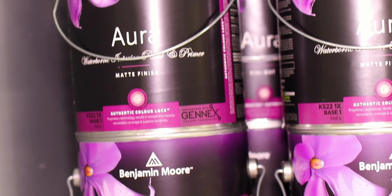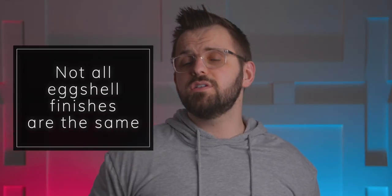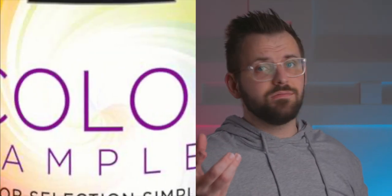If you want to know more detail about finishes, I'll link our finishes video down below. If you are really set on something like a matte finish, just know that the tester pot you'll get will have paint that'll appear a bit shinier than what you'll end up getting. Speaking of that eggshell finish, here's another quick pro tip: not all eggshell finishes are created equal. The actual sheen level can differ slightly between the same finish in different products, and this can be very problematic when you're doing touch-ups. You may be tempted to grab a tester to fix a small scuff on your eggshell wall, but I would discourage you from doing that. Touch-ups are always tricky because not only do you have to nail the color, you've got to nail the finish as well. Even if you thought you used an eggshell finish on your walls, the eggshell finish in your tester might not be the same.